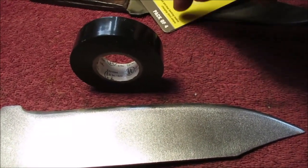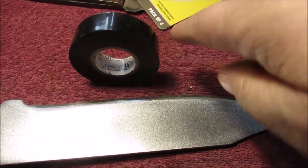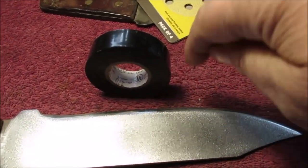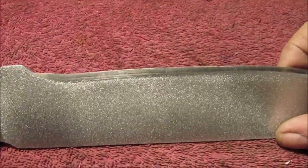Stay off to the sides. Like go back and forth over here and go back and forth over here. Don't go in the center of the belt, because if you look at that plastic roller, it's got a crown to it. So just a little tip when you use that cheapy sander with the plastic rollers in it. So enough yakking about that. We'll bring you back when we're all done.